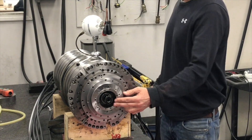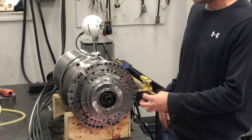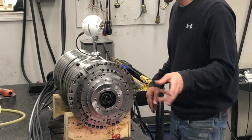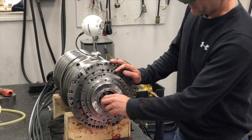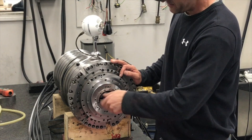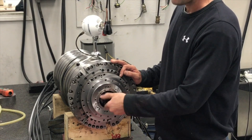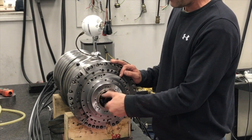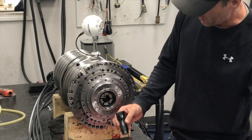Because it's being actuated, it kind of closes the fingers down. So you want to actuate it just to crack that set screw, and after the set screw is cracked you want to release it. From here you can simply unscrew the gripper cone — there are many different names for these: gripper cones, I've heard 'schnobel,' other words for it. But it's the cone. That's pretty easy — looks like it comes right out.